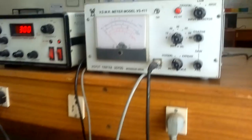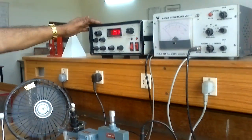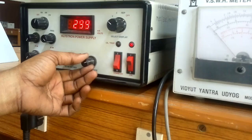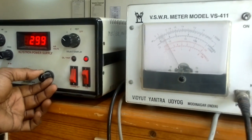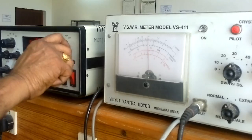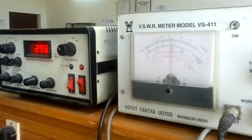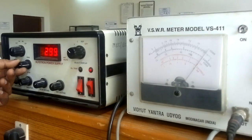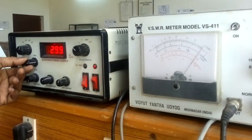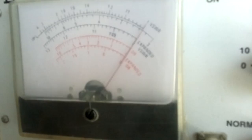Without the load connected, we set the directional coupler reference to 0 dB as observed in the output. To do the tuning in the power supply, start from the repeller voltage at maximum and find the first deflection. Where you see maximum deflection, leave it there. At that point, our repeller voltage is at 128 volts. Then set the frequency from maximum towards zero where the deflection goes. Leave it there — that is the tuning of the AM frequency. If it is beyond 0 dB, set it with the help of the variable attenuator.